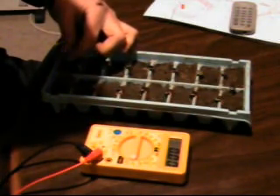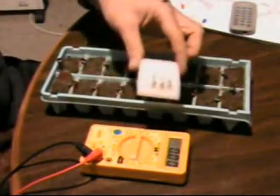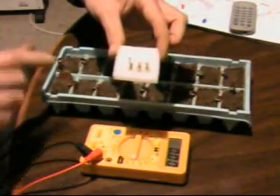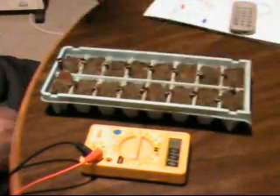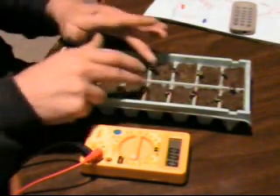You could make them in series. Now again, you remember the last video that I showed you with the little mini cell, which I've got here. This was a little mini cell I used, made of just straws cut off at the end with bits of tissue in it, and vinegar. Also I've got copper and zinc in there as well, and this little baby there was punching out about six or seven volts. And there's no reason that I have to have such large cells here.